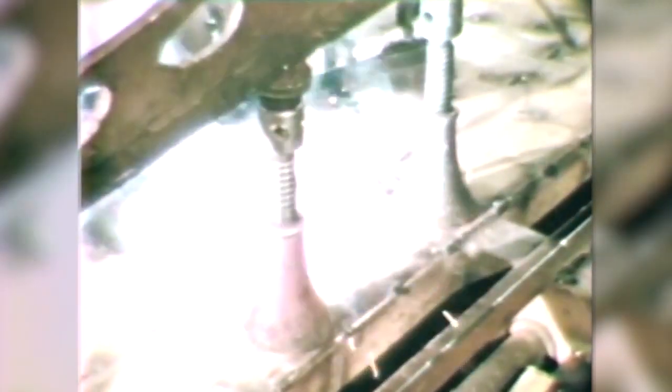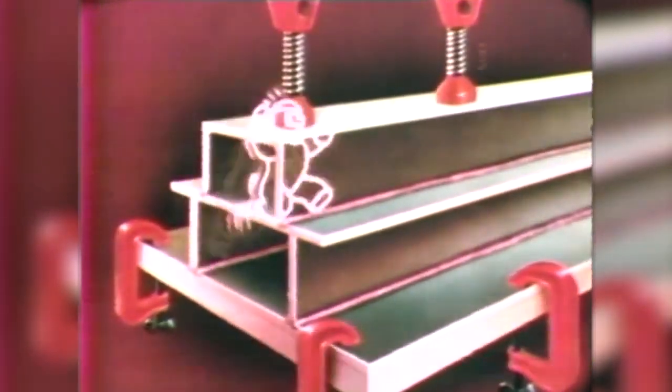But in most cases, the plates to be welded are merely parts of a structure, and other sections will continue to hold the plates as rigid as if they were clamped permanently, thereby reducing distortion to a minimum. Here is a practical application of this principle. These heavy fixtures clamp the aircraft tubing of this fuselage so rigidly that distortion is impossible. The type of jig or fixture required will be determined, of course, by the nature of your welding job. Here's a setup where we have every possible shrinkage force balanced with other forces. The more Shrink pulls, the more exhausted it becomes.